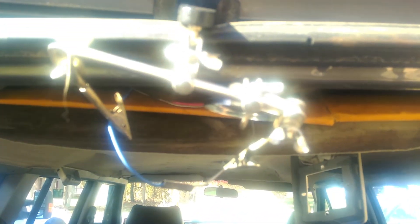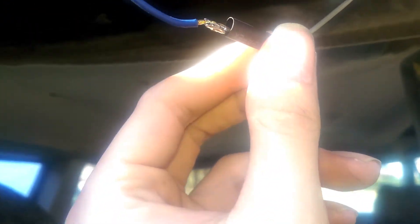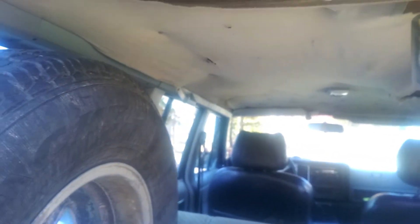These little helping hands — extra helping hands or whatever you want to call them — are extremely helpful. I use them to hold the wires in place while I solder, which makes the job a whole lot easier. With the solder in place, the solder joint is done. Put your heat shrink tubing over top. Same on the other side.